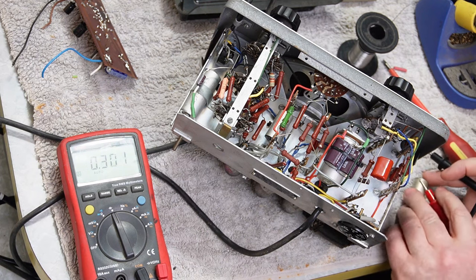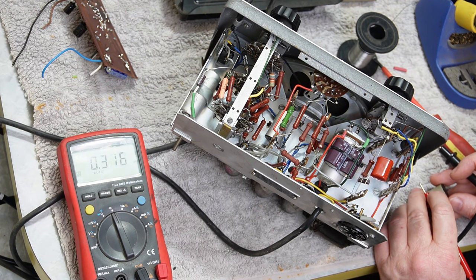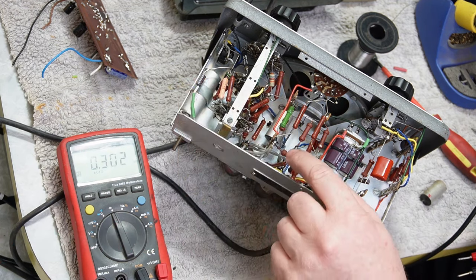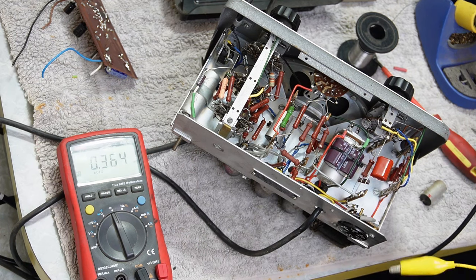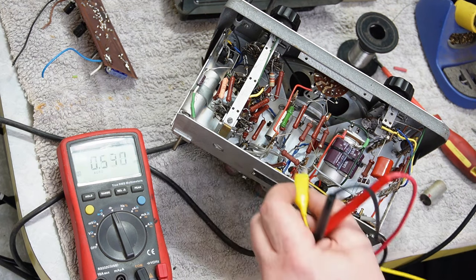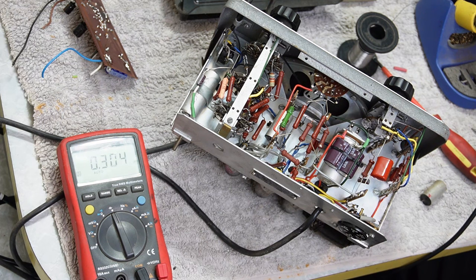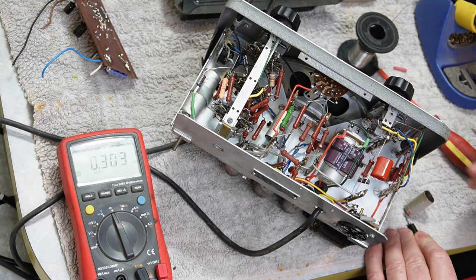This is the kind of thing that can actually cause you a great deal of grief if you're not thinking. One of the tricks that I learned from John in Arkansas, actually, a long time ago, was to use alligator clip leads. And as you take a capacitor off, clip one clip where it came from on one side, just take the other side off, clip a lead on there. And as long as you do one at a time, you can't forget where it came from. It only takes the doorbell to ring or the phone to ring or someone to call out for you, or the dogs to appear in the middle of the night, and you've immediately lost track. Now, luckily I do know where I was at, and I can put this back where it came from, but it's a real gotcha, and it's really easy to get distracted by something like what just happened, and then you're in trouble.